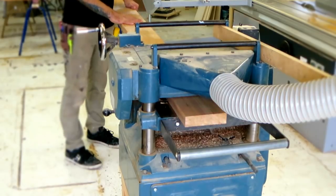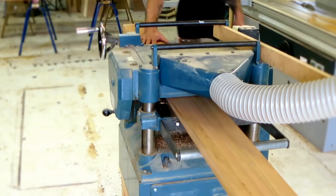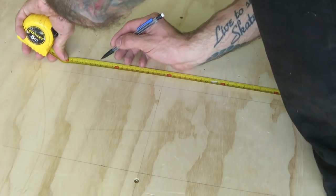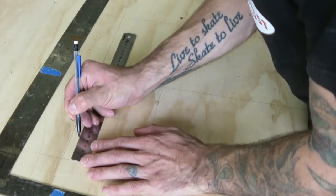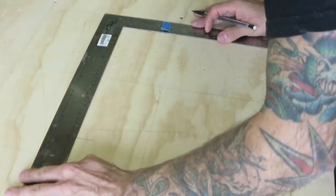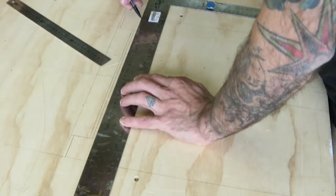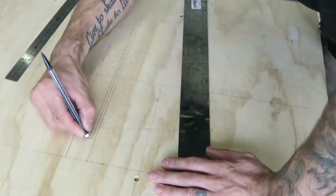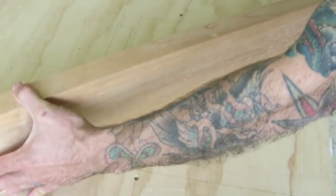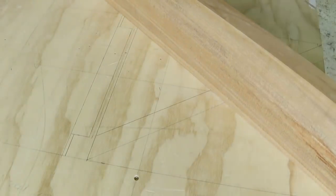While that's all drying, I could machine up the Pacific Island kauri to make the base of the seats. Then I could lay out the actual shape of the X-legs in full scale on my bench top, using a piece of the thickness leg timber to draw in where the legs will go, and then measure off this drawing to get my angles.